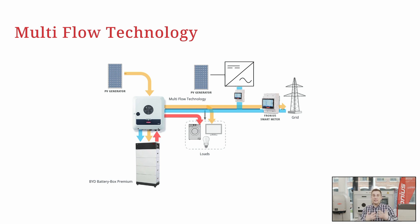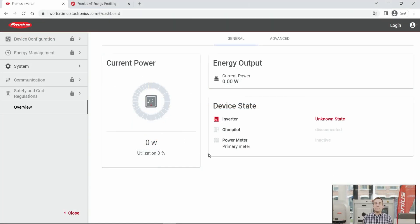If you want to visualize and monitor a third-party inverter, you can install a secondary smart meter in the system. This ensures that energy flow, consumption analysis, and production analysis are tracked with the secondary smart meter, giving you perfect visualization and monitoring. Next, let me show you how to add such a secondary smart meter and a battery storage to your Gen24 Plus system.